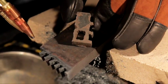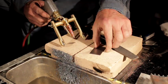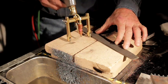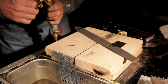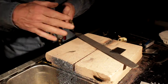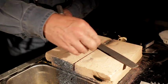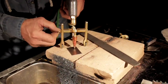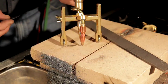This right here is our cutting attachment — it gives you a nice steady hand and a much nicer, more precise cut. You can get a little straight edge or flat bar as a guide. You can also push on thin metal. If you want to bevel or miter, you can adjust it up and down, bevel or miter either side — pipe or plate. Keep a little piece of metal in the kit, one sixteenth of an inch or less — always push the cutting tip right on top of it. If you're pushing, it's on the bottom; if you're set, you're ready to go.